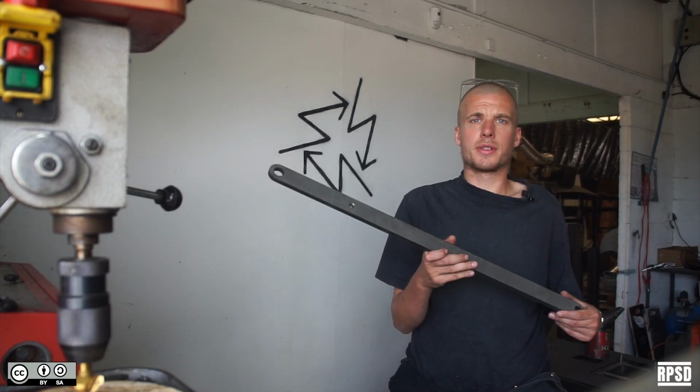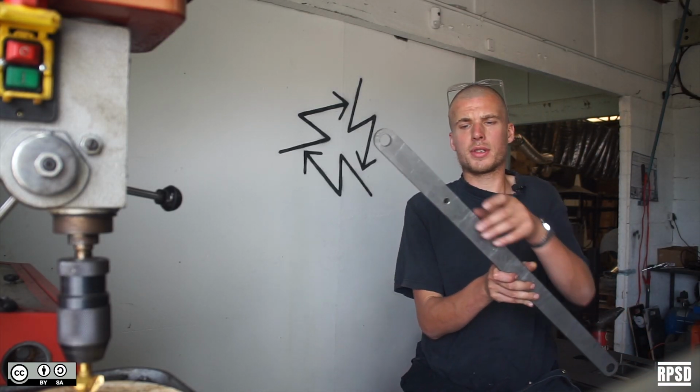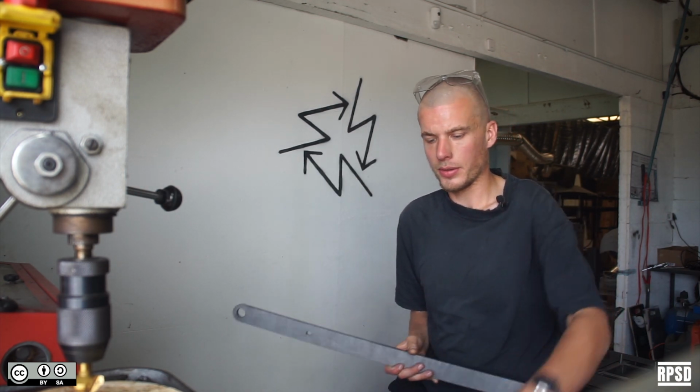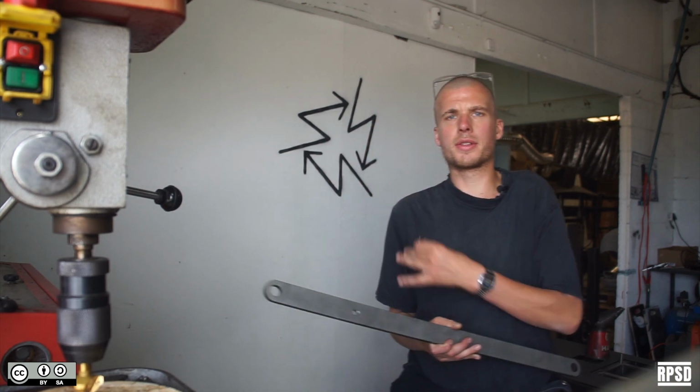Next, take the longer pieces to build the legs. You'll notice on some of them there is a small M10 hole. Use a countersink to make sure that the M10 bolt sits below the surface of the piece.